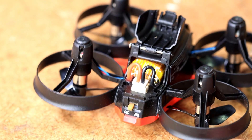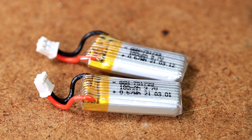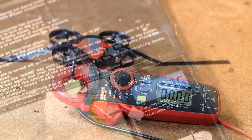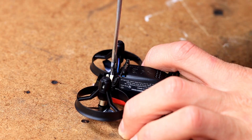The small LiPo battery sits inside the case — we can definitely use that storage space efficiently. Such a small LiPo battery has a capacity of around 180 mAh and weighs about 5.76 grams. Before we disassemble the drone, we need to know what kind of power it needs during flight. At a voltage of 3.7 volts, a current of 2.85 amps flows at full motor power, resulting in a power of about 10.5 watts. That's quite little — let's start with the modification.